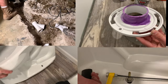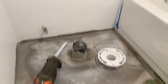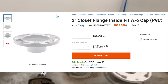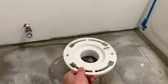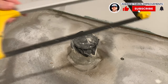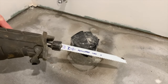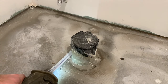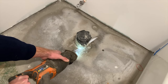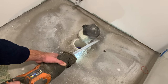With the initial plumbing out of the way, let's move on to step two: installing the toilet flange. We're going to cut off that three inch stub flush with the floor so we can install this three inch closet flange, which attaches to the inside of that pipe. To cut the pipe flush with the floor you have a couple options — an oscillating tool or a hacksaw — but I opted for a reciprocating saw with a long enough blade that I could bend it to run completely flush with the floor. Make sure that when you cut off the pipe, it doesn't fall down into the actual drain.